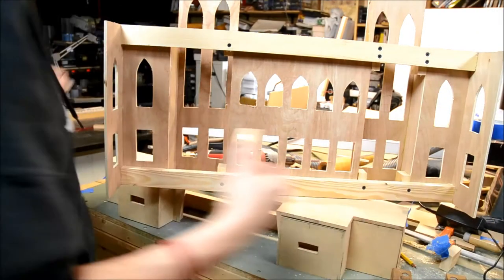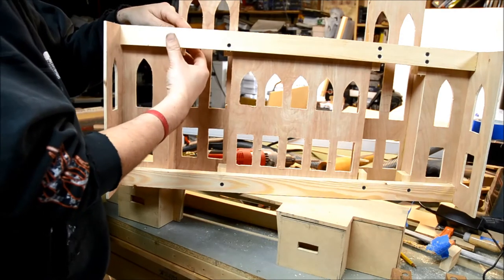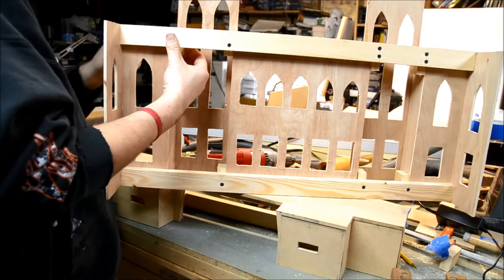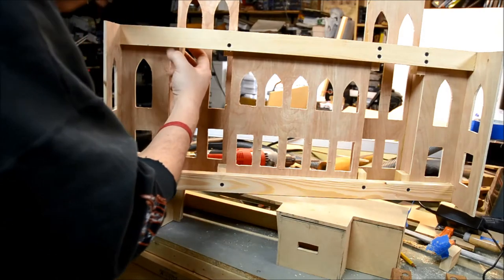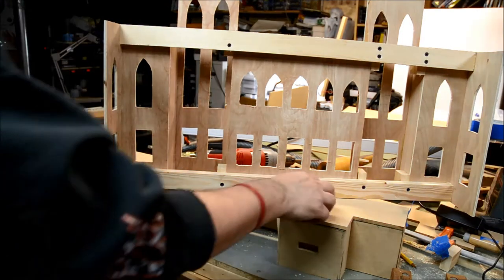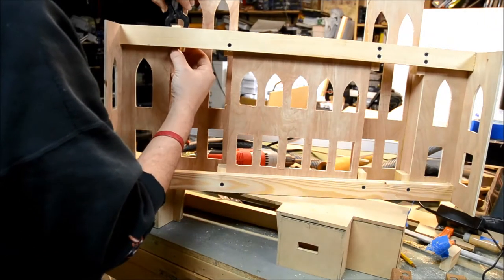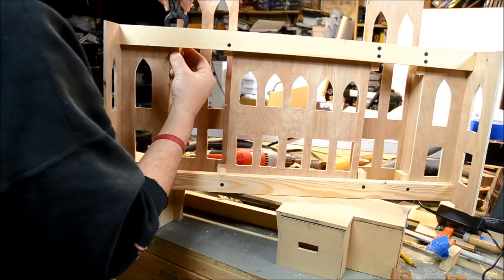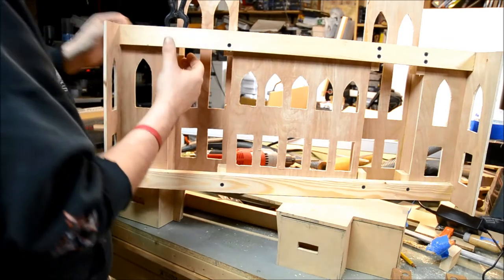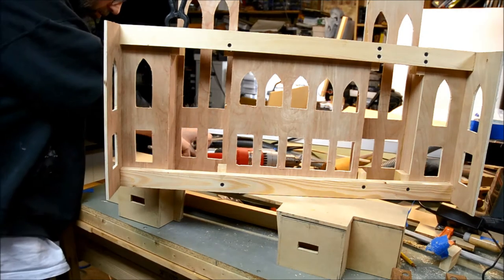What I need to do now is, because I put that side panel in — that two-inch panel — I need to put a block behind there so I can further secure that horizontal beam to the blocks that are attached to the panels. So I'm clamping that block in position so it's flush against that inside corner.